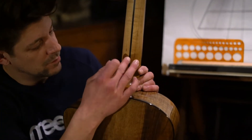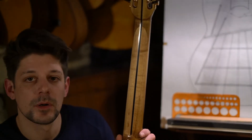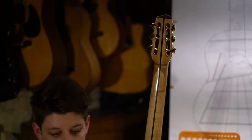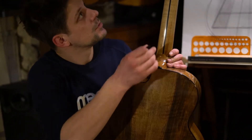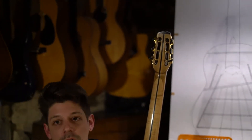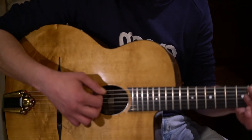And then for the neck, we have a flamed maple neck with an ebony reinforcement. That was also a choice to obtain a neck that is quite flexible and responsive, as opposed to mahogany necks which are a little stiffer. There is also the little specificity of having a small ebony cap at the top of the headstock, which gives it even more character — as if it didn't already have enough.